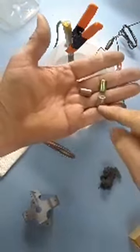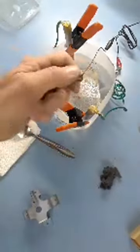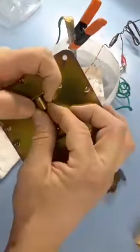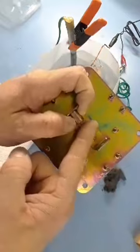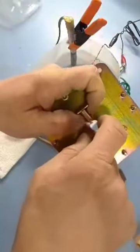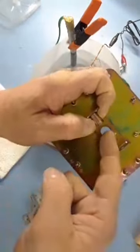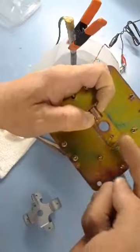I also have these little guys yellow zinced — they're the same as these. These are bearing guides or bearing holders. They're screwed to this plate, there's a spring in here, and a ball bearing sits in here. An eight-sided gear sits in the middle and when you rotate the dial it locks into place at every indent. There are two of them, one on each side.